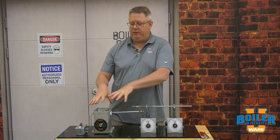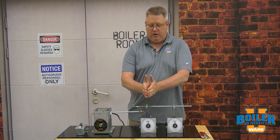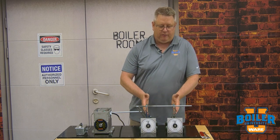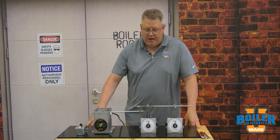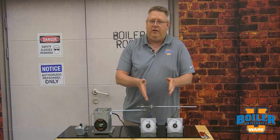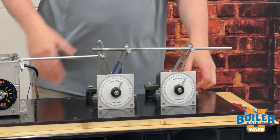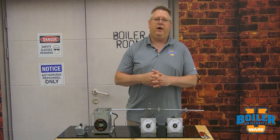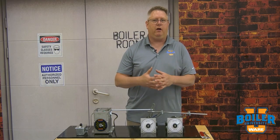To start with, I've got a mod motor set up for a standard 90 degree stroke. I've got the arm lengths the same from mod motor to the first jack shaft, and the arm lengths the same radius length on the first and second jack shafts. So we can drive that through the range and what we'll see is approximately 90 degrees travel on each, moving at the same speed with equal degree changes throughout. That is the simplest way to set up linkages, but it doesn't always match the flows we end up getting through our air damper and our butterfly.